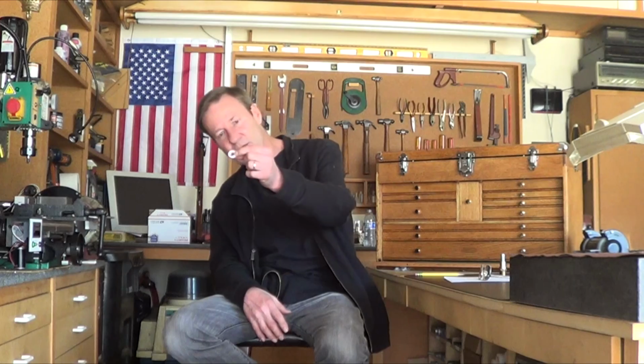And it was a kick too, because now I'm just looking at the gears because I've got it all back together, and I noticed that two gears aren't really meshing completely. One's slightly off. So I made a little spacer with the keyway to put it back together, and I took the little gear off and I put the spacer on it, put it back together, tried to turn it by hand. I couldn't turn it. So again, if I had not done that, I would have damaged another gear.